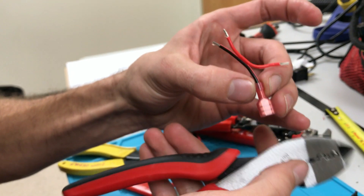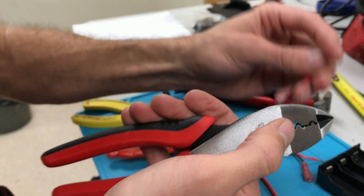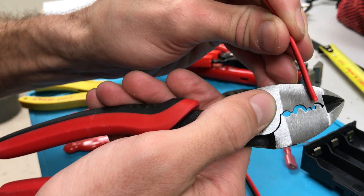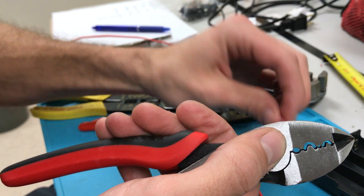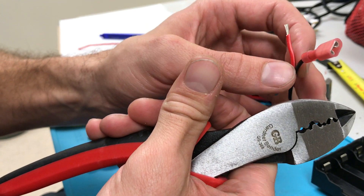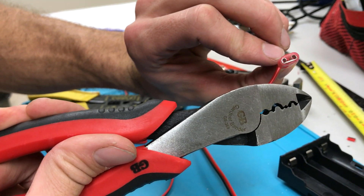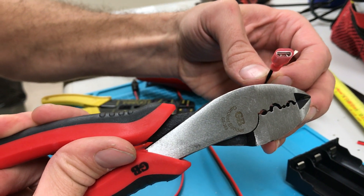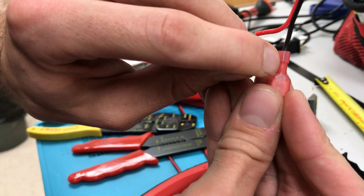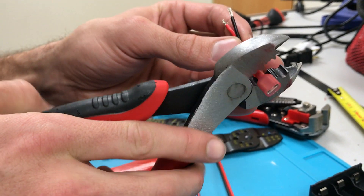Then you want to grab the crimper. I'm not sure which one works better but both humps will work — there's location A with the smaller hump and location B with the larger hump. Both will crimp the metal cylinder inside into sort of a U shape. I think it's more reliable if you keep it oriented up or down, because inside your connector there's a split right about here, and if you put that split on the middle of the curve it cooperates a little better.